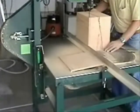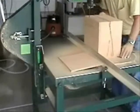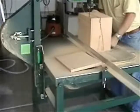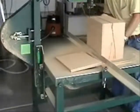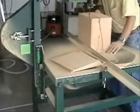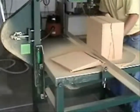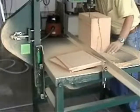My son got to asking about some artists' palettes a couple of days later, and I ended up turning all these little boards into nice little hardwood custom palettes for him. I just traced out a pattern and cut the whole stack at once. I used a hole saw for the holes, but I guess you figured that out. I only hand sanded one of these, once over with 60 grit and then cross sanding with 120 grit. I don't know if you can see this on video anyway.